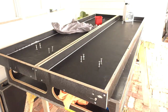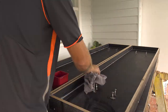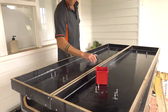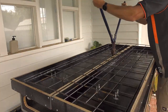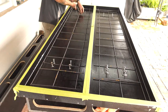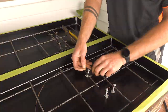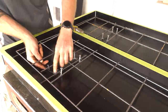Seal up around the bolts, then we put the release agent on — a bit of lanolin. It's not really necessary with brand new ply but it just helps. I'm cutting the mesh leaving a bit of cover, and I'm tying up the middle of the mat because it was sagging. Here I'm just using the bolts to set the height of the mesh. I found using pliers to tie very awkward.